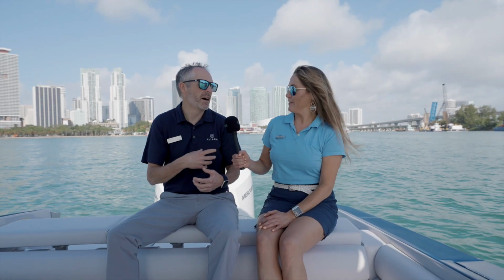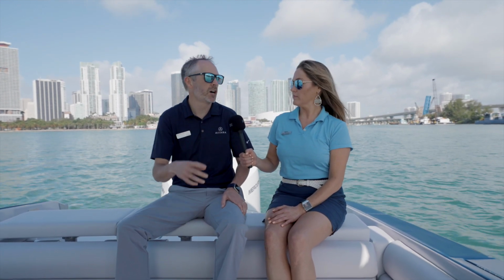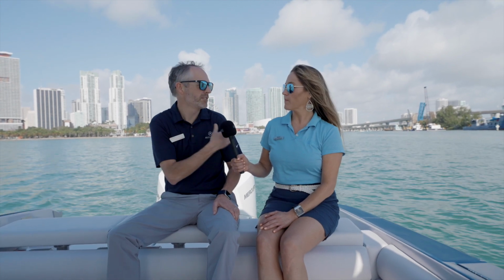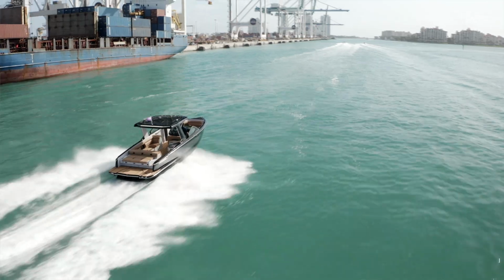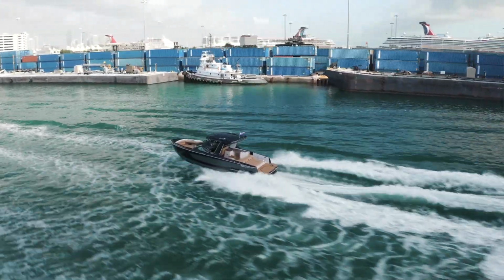The outboard's what's great about those, though. If you are going to be storing the boat in the water, you can trim the engines fully out of the water. The stern drives are going to be in the water, but if you're in a saltwater environment, you're able to keep it on a lift or high and dry, you actually have a stern drive option. And they both have the joystick piloting, which is great. So it's an important decision when you're deciding between inboard and outboard.